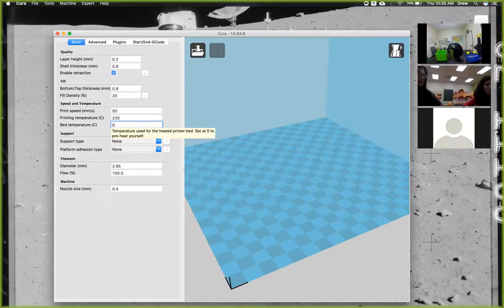So I'm just curious, like, you know, on Maker, and don't mean to get off the subject of your equipment, but those beds heat. Yes, they do. They're required to heat. Right? What's that? They're required to heat? Some of them, yeah. Some of the MakerBots do. But you don't have to print with a heated bed. If you do, though, with any sort of PLA, I recommend heating it to 50 degrees. So on your MakerBots, you can set them to 50 degrees, and then that's a good printing temperature. Because I have a lot of experience with MakerBots. We don't sell them, but I've had a lot of experience with them, and we also have printers that have heated beds, and for PLA, you just want to have the bed set to 50 degrees if it has a heated bed. Okay.